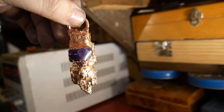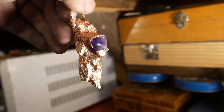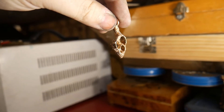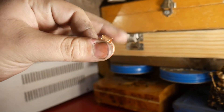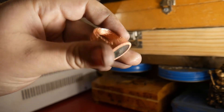Some power supply tips: a lower voltage for longer will produce a cleaner plate. But if you wait a couple hours and then turn the voltage up, it'll have a bunch of nodes growing on it, kind of like a sunken treasure look — I think it's pretty neat. But if you're making something somebody's going to wear, you're going to have to file some of these down.